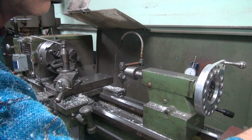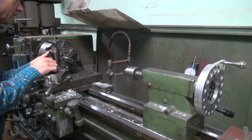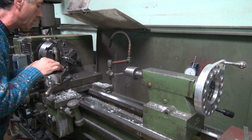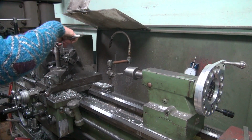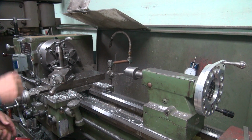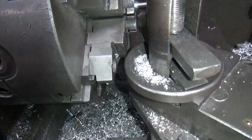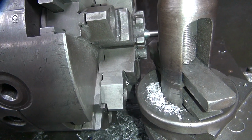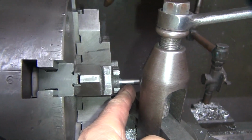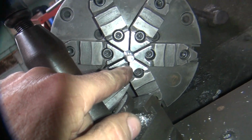Okay, I'm not sure the height I need, so disengage that so I can get over here. Problem with this is I'm not going to be able to get in here very far because we have very limited space over here. So I probably want to be able to cut just a little bit. Excuse me. So we're a little on the low side on my bit. So we're going to have some interference issue with this hitting this. That will cause a problem. So if I go all the way over, you can see I can only cut to here. Whoop. And as this goes in, I can't go nearly as far, so I'll have to close out even further. So we're probably going to be about that far in. But that's okay. As long as the die is started, it'll cut true after it gets going. But right now, obviously, you can tell I'm pretty low.